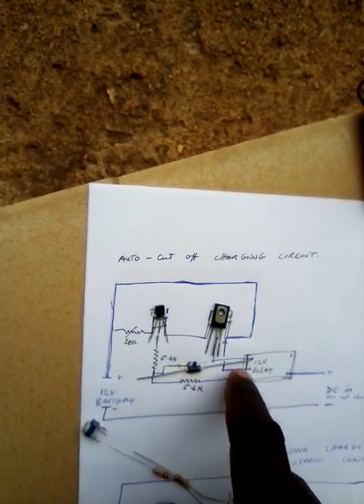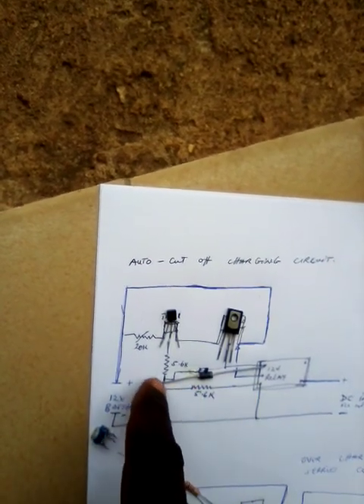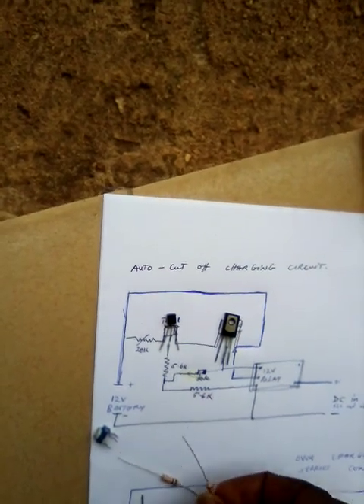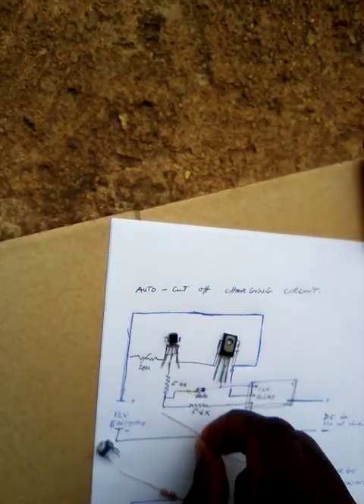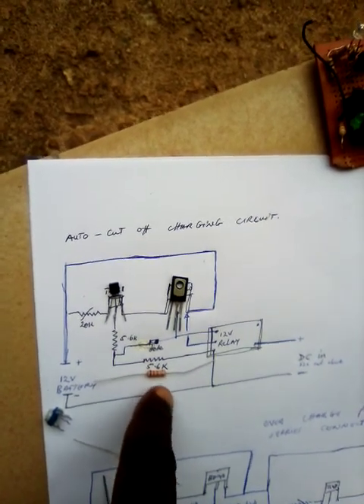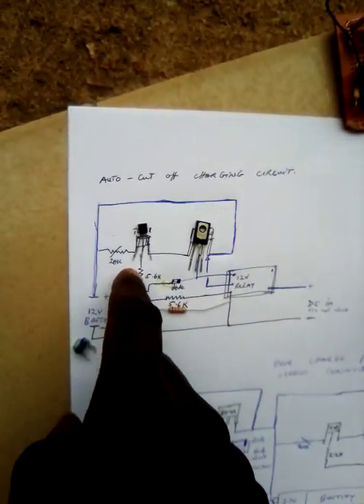The white line is on the positive side. This is what it should block. It leads to the middle leg, and this resistor is 5.6k — it's connected here from the middle leg to the negative rail. These are double 5.6k. We're using double 5.6k because we're dealing with a higher voltage which is around 12V. If it was just 3.7V, a single resistor would have been enough.